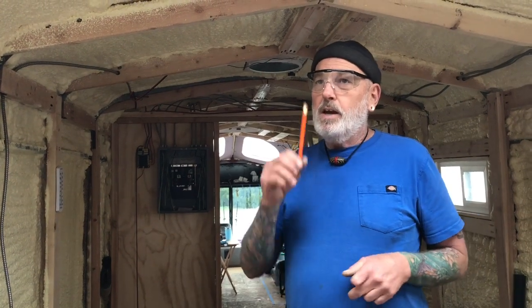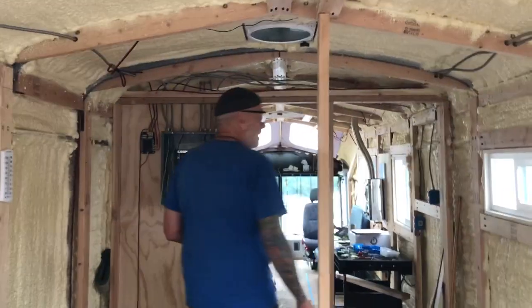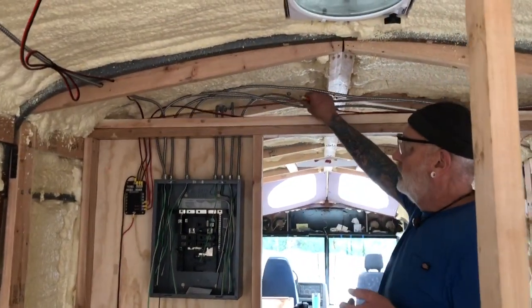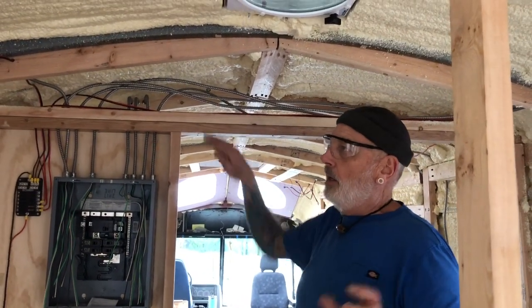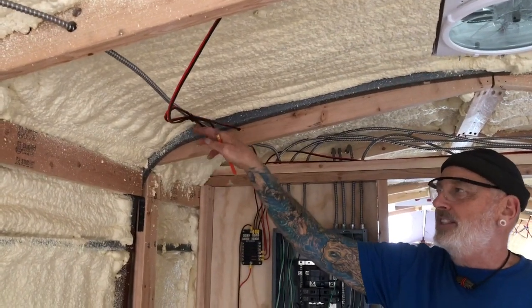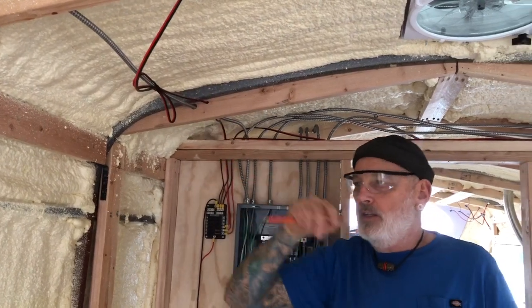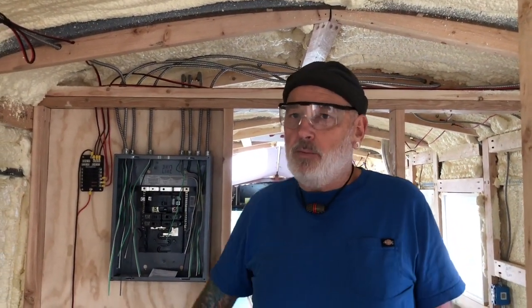In the process of checking all that out, I keep getting feedback to be careful — don't run your 12-volt system wires within 12 inches of your 110 wires. The great thing is that the 12-volt system we just put in temporarily, but from what I've been told you definitely don't want to do what I just did — I took the slack of that wire and strapped it right to the 110.